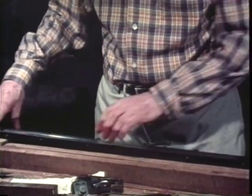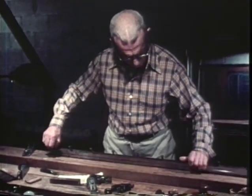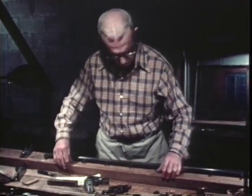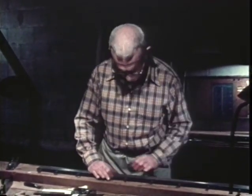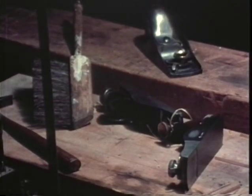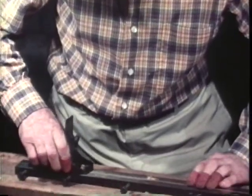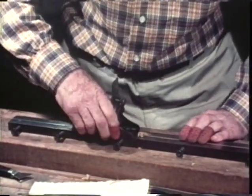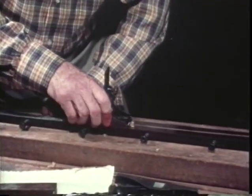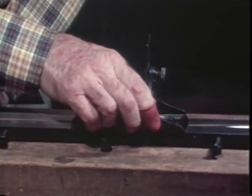We'll turn the forms over to the finished side, where the groove is much smaller. We'll have to change our plane and take a finer cut on this side. This cutting has got to be very careful. We're now going to remove from this one strip the outside enamel. And the purpose of that is to see the fibers as they are and detect any further injury or imperfection.